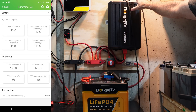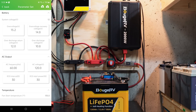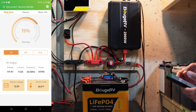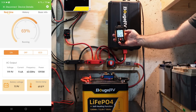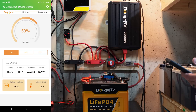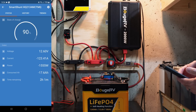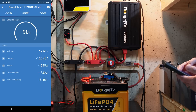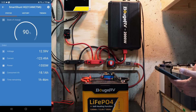I've got a couple of oil heaters plugged in for load testing. Turning on one of the oil heaters kicks off the fan — about 62 decibels from about one foot away. The app shows we're pulling 69% capacity out of the 2,000-watt inverter, which equates to just under 1,400 watts, and we're pulling 11.5 amps AC. Looking at the Victron smart shunt, I'm actually pulling about 123 amps from the batteries — so I need to be careful not to exceed the 200-amp continuous rating.